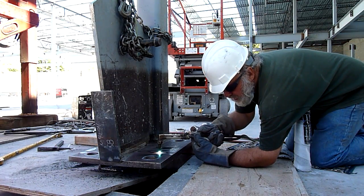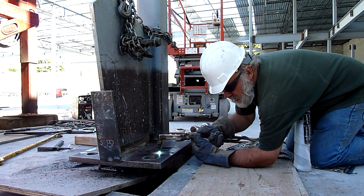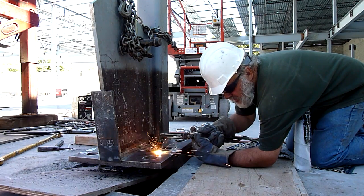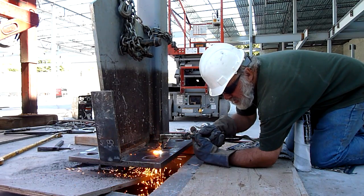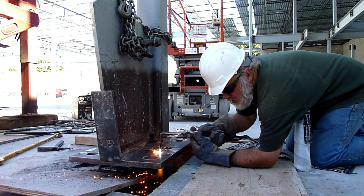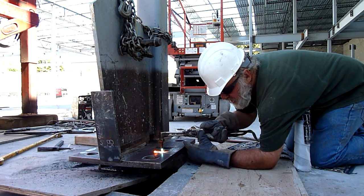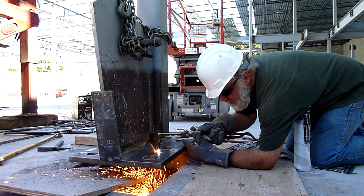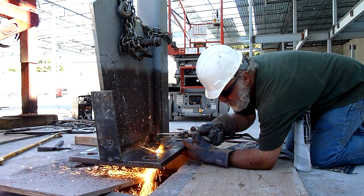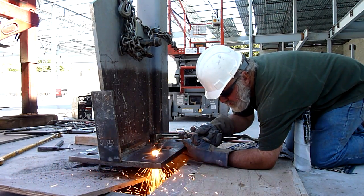You're going to burn a one-inch hole here. It's heating until it gets kind of cherry — it's going to look kind of shiny. When the oxygen goes up and back, you start moving. There you go. I'm going to use my hand to hold it down — three inches thick — and just go through. Voila!